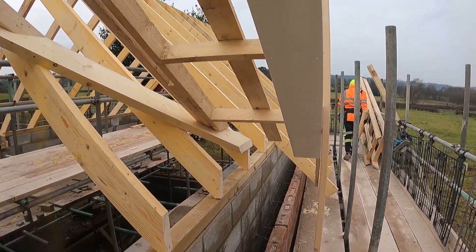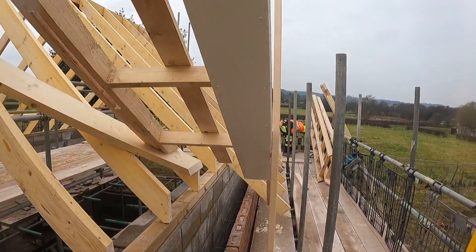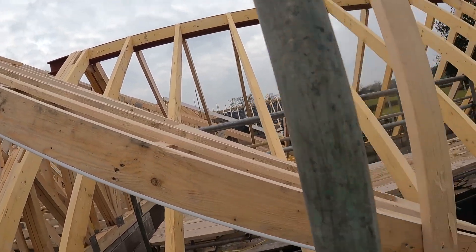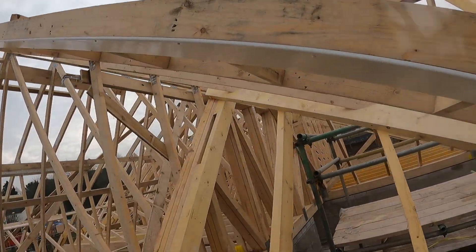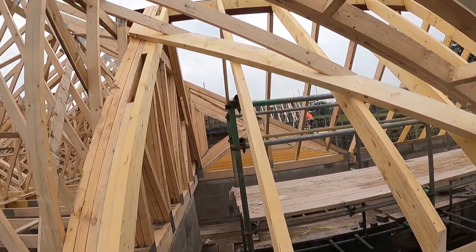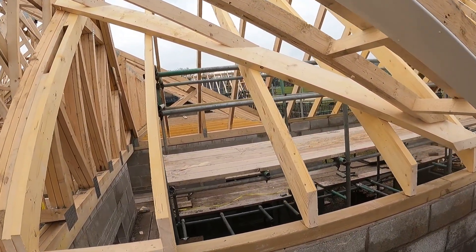As you can see from that last bit, we just checked with the level to check this off — the ladder end's flat that way, and we put a straight edge across the top of them to the other trusses and propped it up, so it's right all the way across and right for the brickwork. Now we'll build the stud underneath, and that will need plywood and vapor barrier on it because there's no block work here, so that'll be instead of the block work.